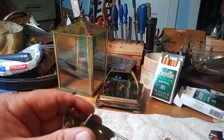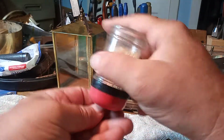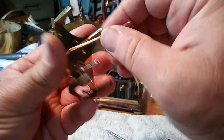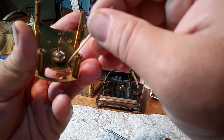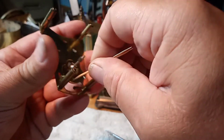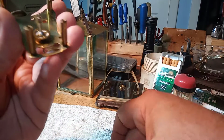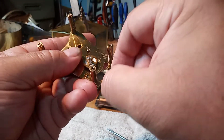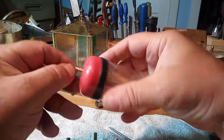because I've said it time and time again, an ultrasonic cleaner is like a dishwasher. It will not, and I repeat, it will not get into the hard to reach spots. You can take a toothpick prior or afterwards to these pivot holes, but if you do it afterwards, which I highly suggest that you do one day, you will notice that your toothpick comes out dirty.